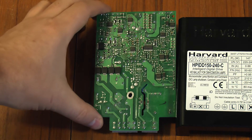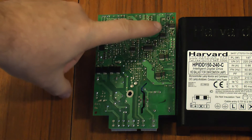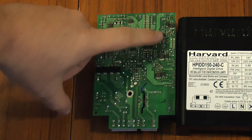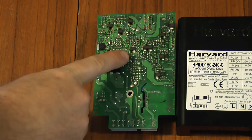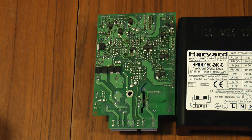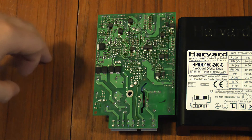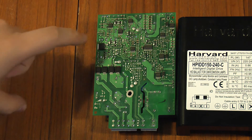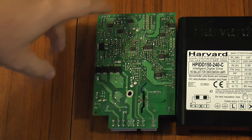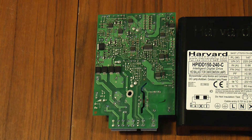As you can see there's a lot of kit in here for what it does. We have three L6384D high voltage half bridge drivers, an LM358 op amp, an LM393 comparator, a 33262 which under the datasheets is a power factor controller, a 7815 15 volt voltage regulator, another LM393, and a PIC16F630 controlling the whole shooting match.